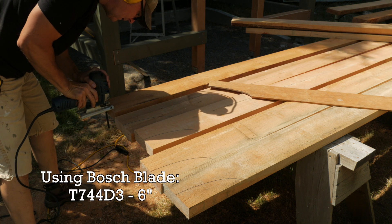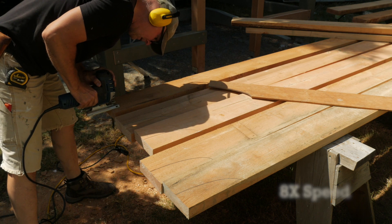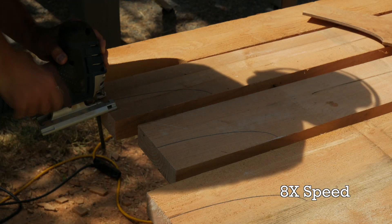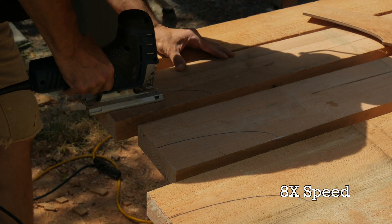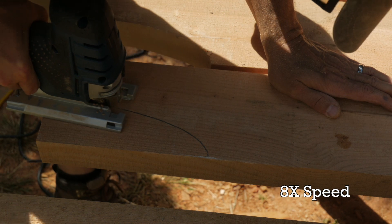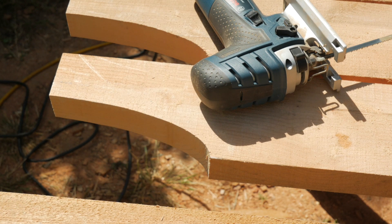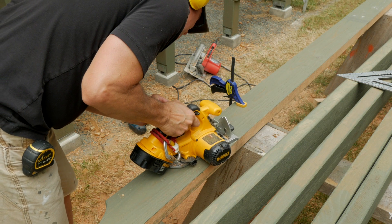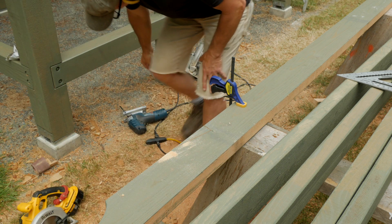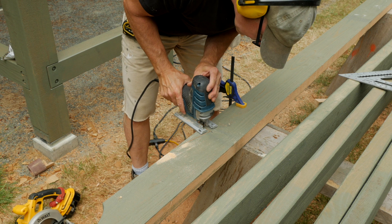It has worked very well at cutting curves in beams and rafters with very little blade wander. I'd say that all jigsaws have this issue but this Bosch model has a minimal amount, certainly good enough for many of my outdoor projects. I've found that you can get better accuracy by going slow and steady and slightly jiggling the saw from side to side — this will help prevent excessive pressure on one side of the blade. I like having this jigsaw handy to finish birds mouth cuts in rafters — I start with the circular saw then finish with the jigsaw, and I used it for just about every project with a roof.